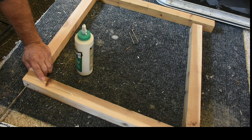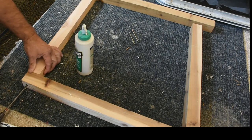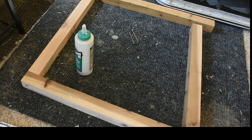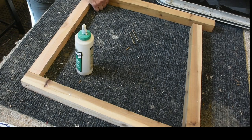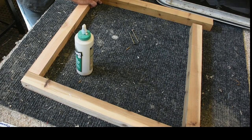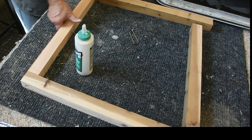You'll get support from the deck itself and the fiberglass wrapping up on it. Once it gets all glued and has a chance to set, we'll round off the corners and round off the top. You need a radius on the corners and top, so the fiberglass can come up and wrap along the top. If you don't have that, you'll never get a nice fit of the fiberglass to the curb. Actually, it's a necessity. You have to do it. You need a radius edge.